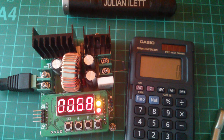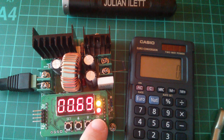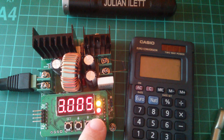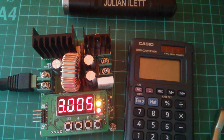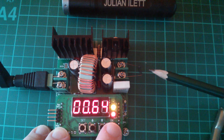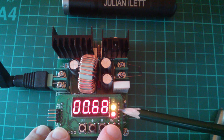Now let's work out the resistance of this little coil of wire — I'm not going to touch it because it's probably hot. R equals V over I, so at the moment we've got 0.7 volts, 0.7 divided by 3 amps. The resistance is — if my calculator had any light coming through the solar panel — 0.2333 ohms. So this is a very low resistance load, about a quarter of an ohm, which explains why we're getting a high current but a very low voltage.